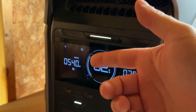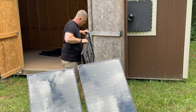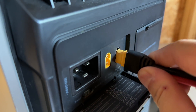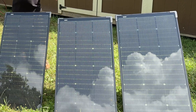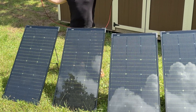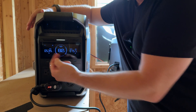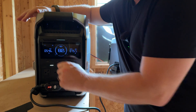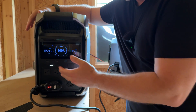The 500 watts of solar panels are a bifacial design, and right now over the last few minutes I've been pulling in more than 500 watts — very impressed with those bifacial solar panels. Most companies, when they advertise a solar panel, you will never get more than the rated capacity of those panels. I was hitting 550 watts, and that is honestly nuts. I never would have expected to get that much power from those 500 watts of panel.